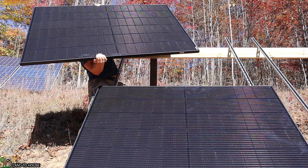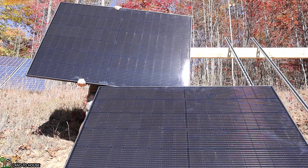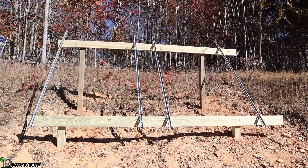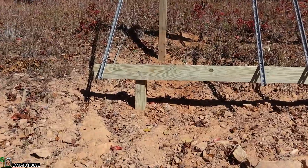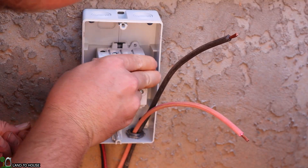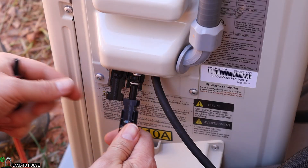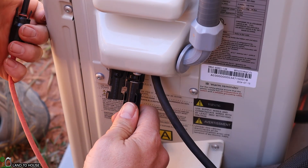This unit is the hybrid version, so it can do both AC grid power and DC solar power. The unit came with four solar panels. I made a little ground mount — just some 4x4s stuck in the ground with some Unistrut — and mounted the panels straight to that. I ran about 50 feet of solar cable to the unit. I have a disconnect for daytime maintenance, and that simply plugs up to some MC4 connectors and you are good to go. If you watch my full install video, you'll realize you just take it in steps and it really is not that bad.